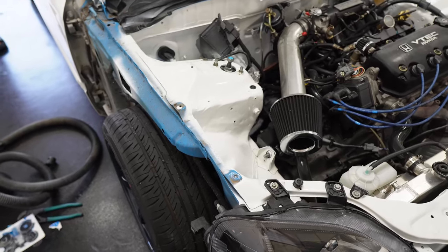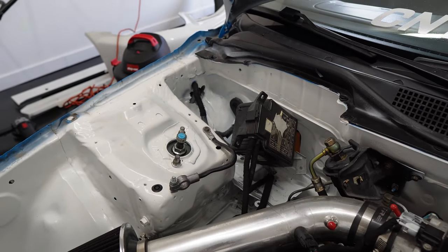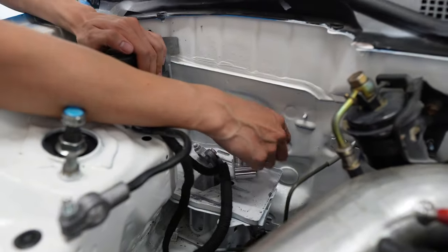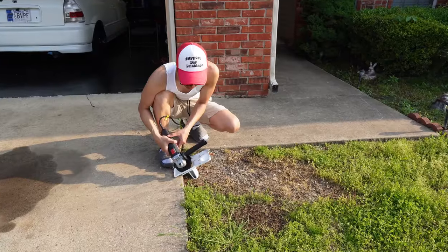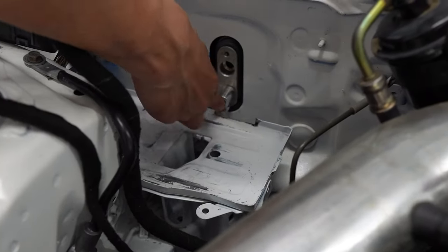Because this is not really a show car per se, since we are going to boost it, I just want to make it as clean as possible but OEM. It's going to go towards this evaporator. I might have to cut this battery tray a little bit just to make sure that these adapters clear. If you're already running a relocation kit, you don't need to do that. It barely clears, as you can see right here.